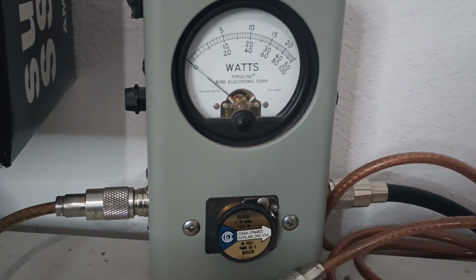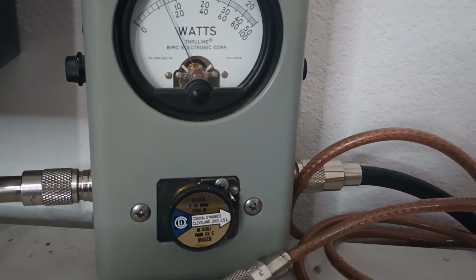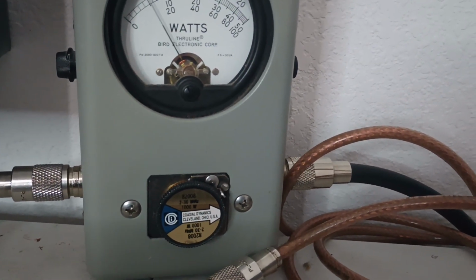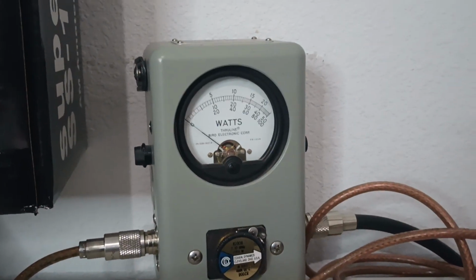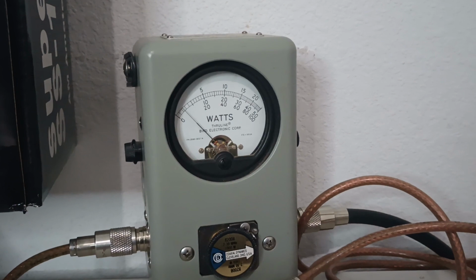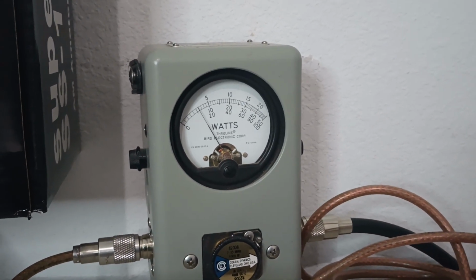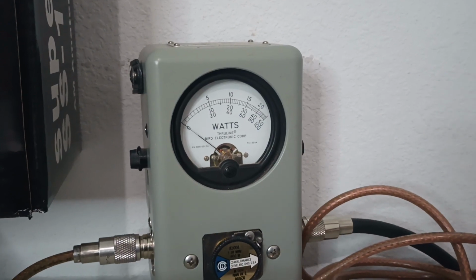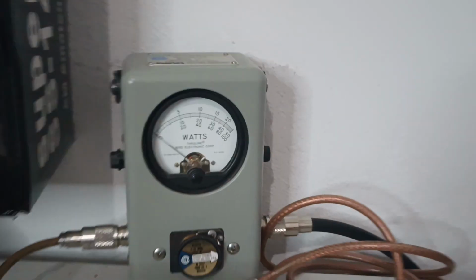And now we'll go 12 o'clock with the RF power. Hello, audio. Audio. And that's probably the optimal setting for the radio, running it by itself. That's about a 40 watt dead key, swinging 140 average, and still going to have that 500 watts worth of PEP.